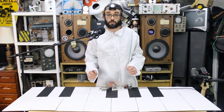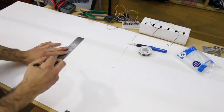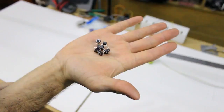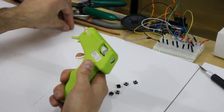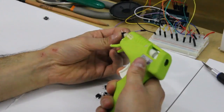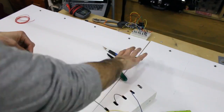So let's see how I built this big keyboard. First, with some foam board or cardboard, we'll need to measure out and make even cuts for eight keys. Then each of the push buttons is placed upside down on the bottom side of the keys with some hot glue. You'll need to bend the legs outward so they sit flat, so the button makes contact with the floor when we step on the key.